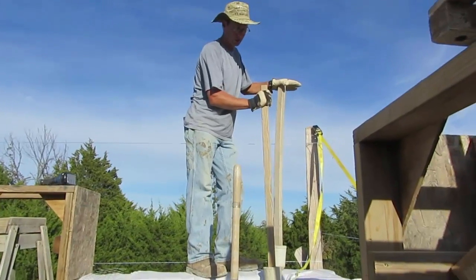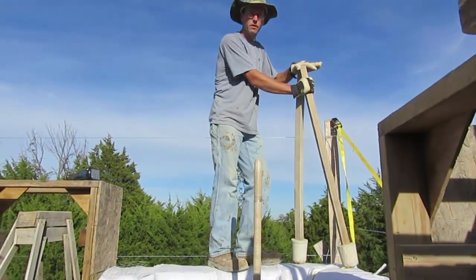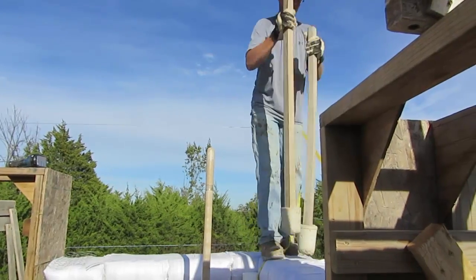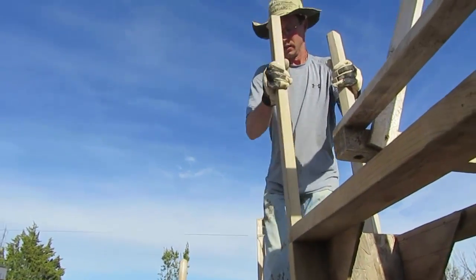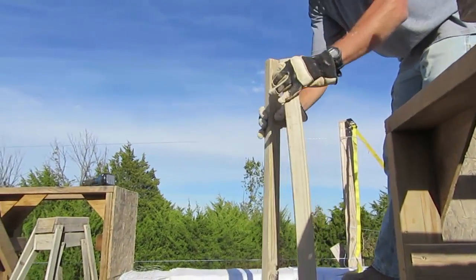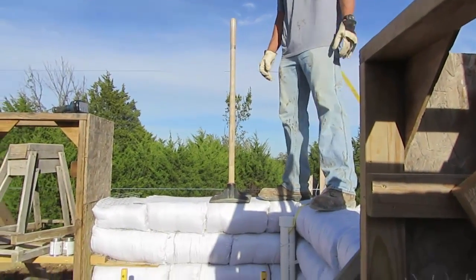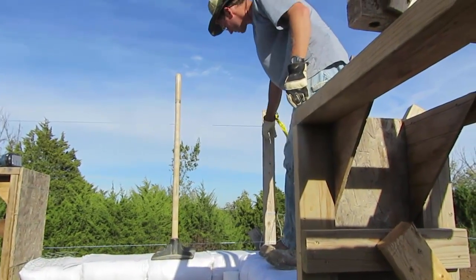If you're curious about this pipe here, I'm going to put a 90-degree angle on it and run it straight through the wall. In the future, we may have rainwater coming off the roof — this pipe goes over to the utility room and into the 3,000-gallon rainwater system. You'll see I have strings in various places, mainly to help keep the walls nice and straight and level. On this post back here, everything's marked — this is nine foot. We're going to have nine-foot ceilings here.